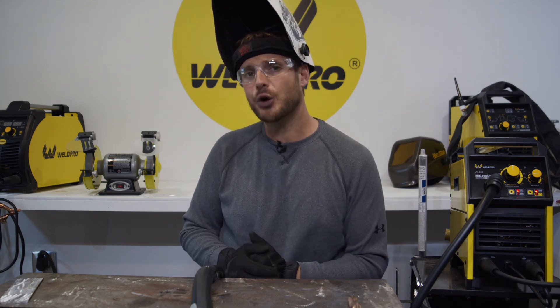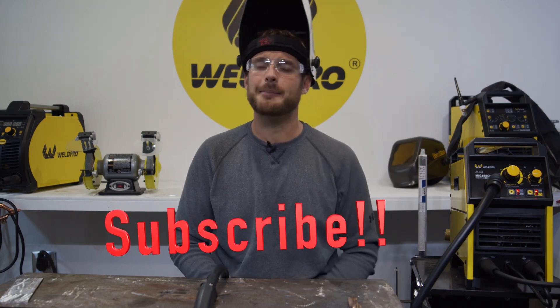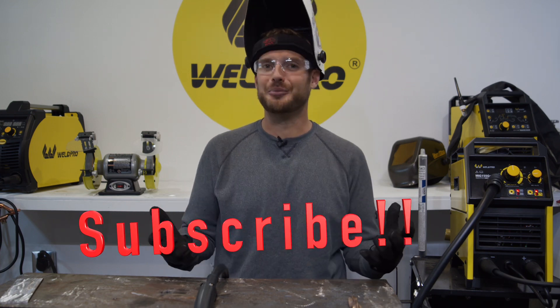The important thing is that we can make these welds repeatably smooth. If you're going to mostly be welding on thicker material, don't be afraid to try different wire sizes like .035 or .040 — sometimes these can work a little better on thicker material. If you have any questions or comments, don't hesitate to leave them below. Please take a moment and hit the subscribe button. Here at WeldPro, we're committed to releasing the latest tutorial and how-to videos to better help you hone your craft. Thank you so much for tuning in today, and as always, we here at WeldPro can't wait to see what you build with your MIG-155.